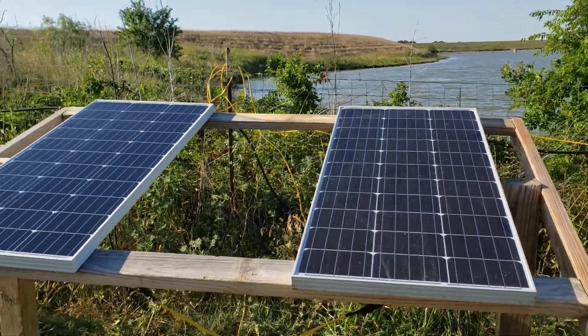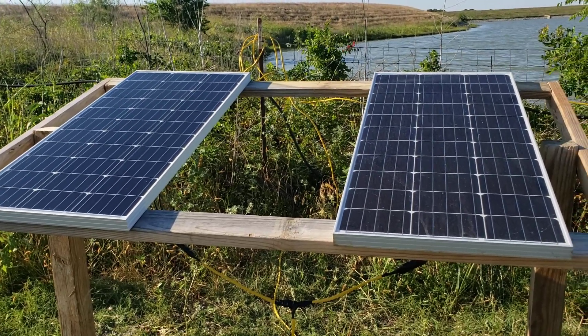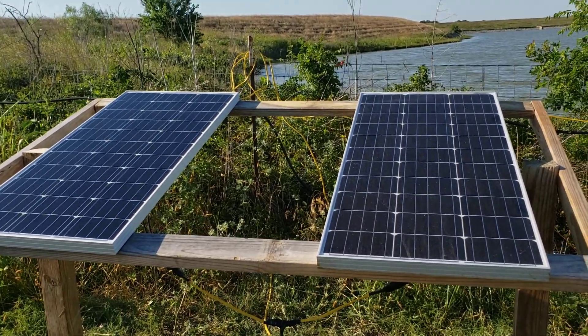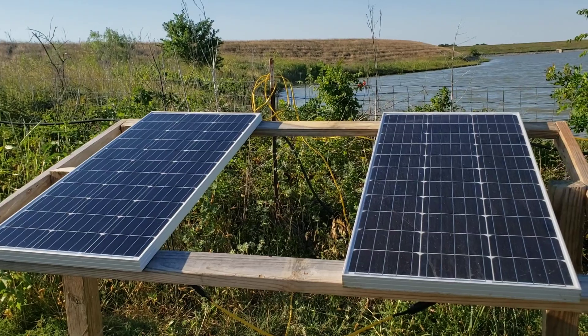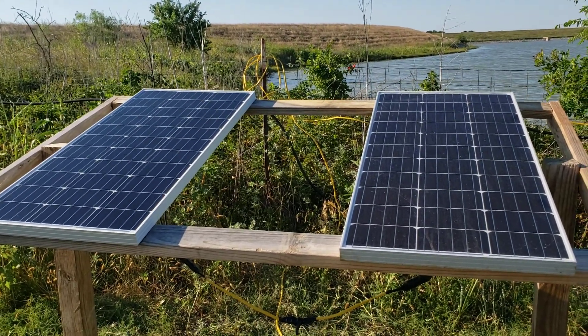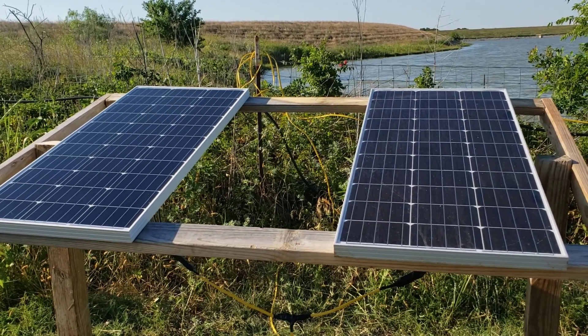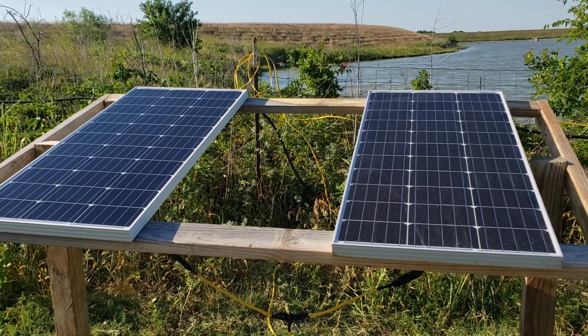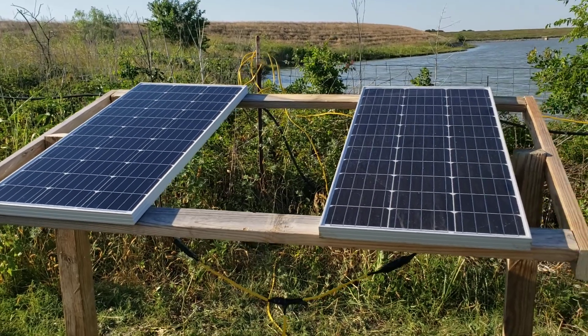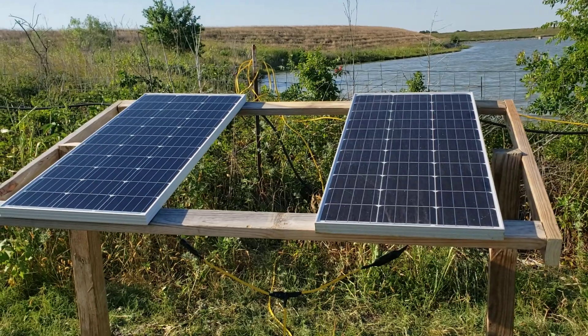I still use some indoor wire. I was always able to get outdoor wire but just never got around to ordering it, and I have a lot of this indoor wire in the garage from when I ran my power sockets in the shop. I'm just using that for now — it'll work fine. It's just copper wire; I don't really need special insulation out here since this isn't a high-voltage situation. But if you can, use outdoor wire.